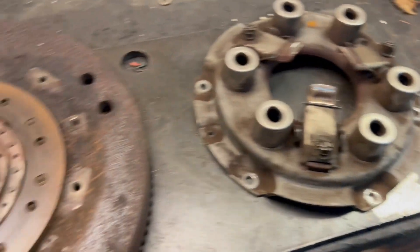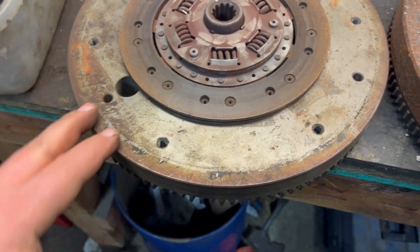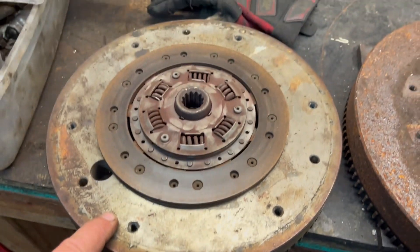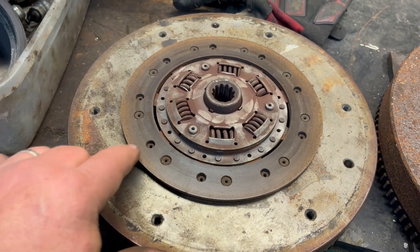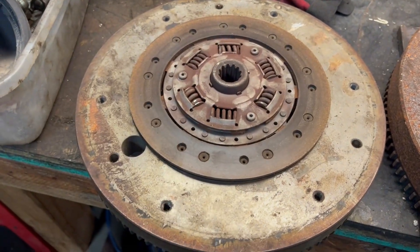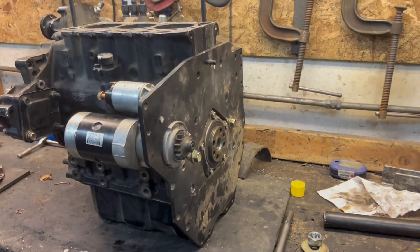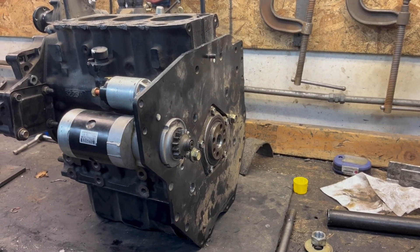Also, looking at the disc and centering it — there's a hole drilled in this flywheel right under where the disc would go, so I don't see how this flywheel would even work. If the clutch that has to go in here is slightly bigger in diameter, it would cover more of that hole, and the edge of the hole would act just like a knife on the inside of the clutch disc. If I could find an adapter plate that would properly align this engine — ensuring the output shaft and the input shaft of the machine are concentric — then it might be worth cutting the bell housing and making this work.